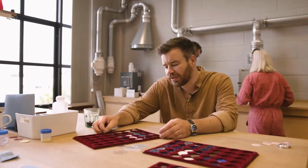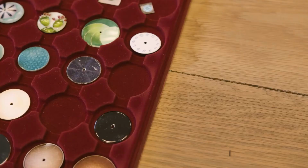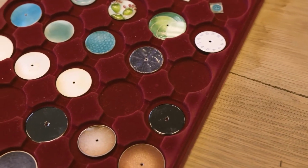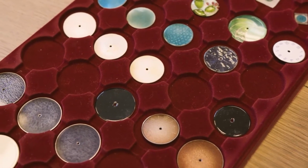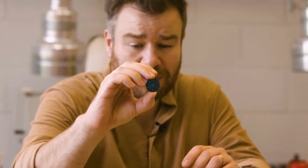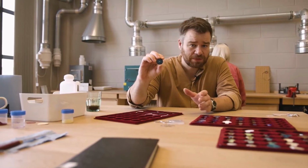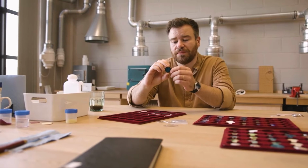I think one really interesting thing we came across was the fumé technique for enamelling, and this style is actually how we discovered it. Originally, everything we did was in copper, which is the normal way of making watch dials with enamel. And we switched to silver because it had some interesting properties and things you couldn't do with copper.